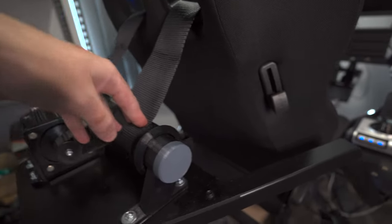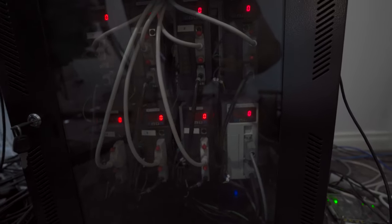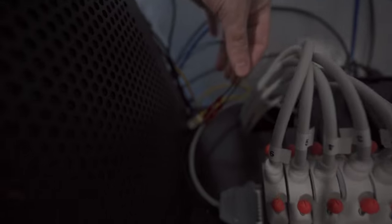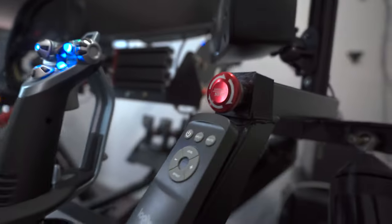Now, this is hooked up to, I got a white version, AASD. Some people are going to hate that, if they've got a bit of OCD, but they're the silent version, so you don't get that 16 kilohertz whine like these ones. Eventually, maybe one day I'll flog these off and spend a bit extra and upgrade to all whites. But honestly, the noise doesn't bother me anymore. I'm so used to it. The DB25 comes in and plugs into the seventh output on the Thanos controller on the side here. Now, I've also intercepted pin 10, and that is plugged in to this e-stop right here.